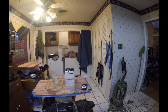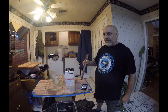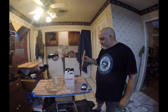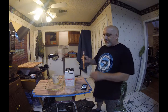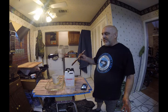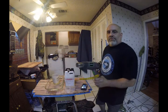Let me go get my stirring stick. Oh, by the way, there's going to be a link in the description to the PDF on how to mix, stir and apply the clear coat, so you can check that out. They recommend stirring for I think 2 to 3 minutes, but you don't want too many bubbles in there. If you stir too quickly it puts bubbles in it, which I don't really care about, because I use a heat gun afterward to get all the bubbles out. So I'm not concerned with bubbles.